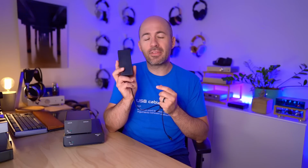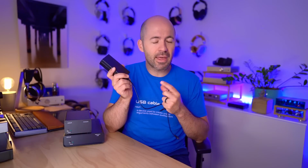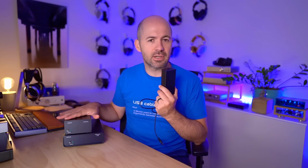And that brings us to the pros and cons. As you can see, the switch mode power supply I'm holding here, despite being a large switch mode power supply, when you think about some of the tiny little wall warts around, this is still a lot smaller than the linear power supplies you see in front of me. And that's because the transistors are much smaller than a full wire-wound coil like you've got in the linears. That's not taking into account the fact that there is also an external transformer that operates with these, so they're even bigger and bulkier still. They're just separated into two boxes.